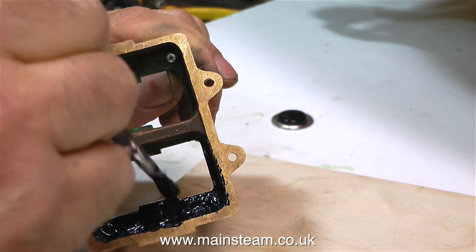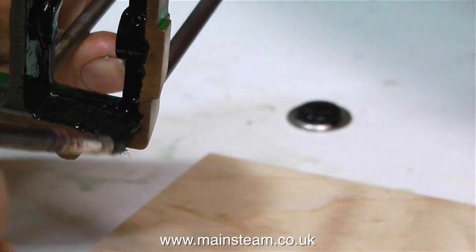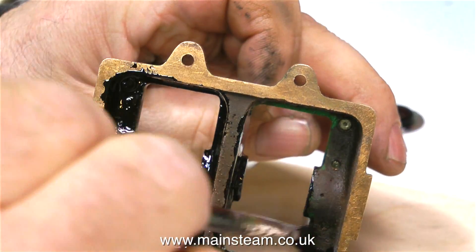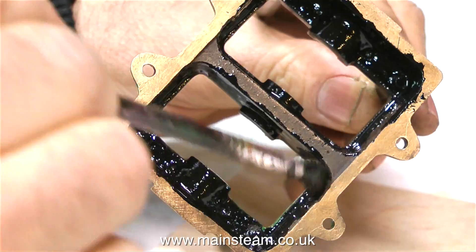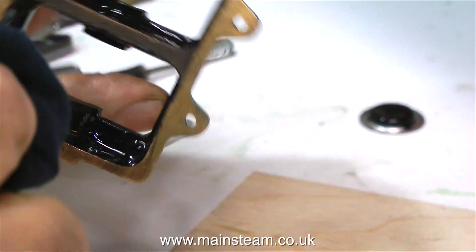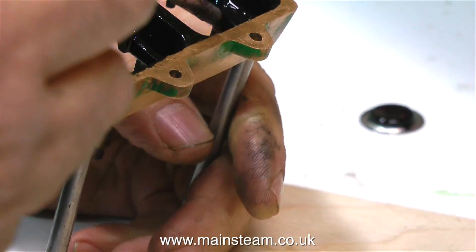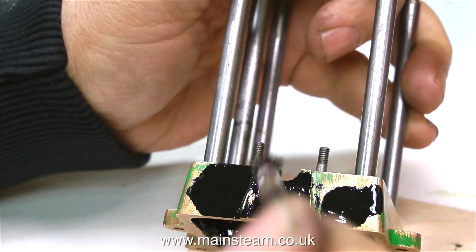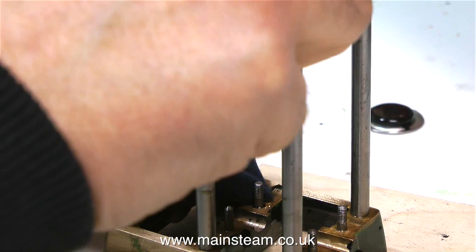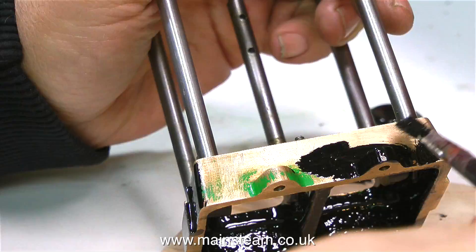I'm using Humbrol Satin Black. I'm painting the underside of the casting first, because should I get any runs — which is likely, because I'm putting quite a good coat on — it will not run onto the top surface of the engine bed plate. I'm really not worried about runs at this stage because this is the first coat, and any runs can be easily dealt with with some wet-and-dry sandpaper. I'm wiping off the excess though; I don't want paint everywhere on the bed plate. I started off using this satin black because I think it's going to look better in a satin finish. But if when it dries it looks horrendous, then I'll use ordinary Humbrol Black enamel. I'm going to leave the top surface of the gunmetal base in gunmetal, because it's going to look really good that way.